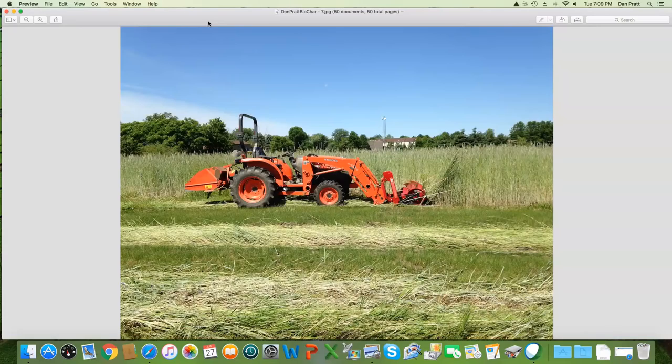The machine on the back is an Italian spader. We used that machine for almost 13, 14 years on the farm. And the rumor was that this spading machine was less destructive to the soil structure than a rototiller or a plow and a disc. But in our use of the machine, and because we're a small place, we're cropping sometimes two and three crops a year on each one of these semi-permanent beds, the effect was virtually the same.